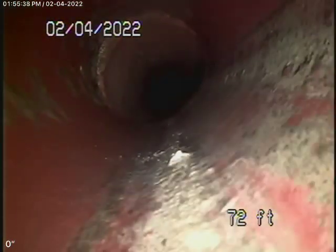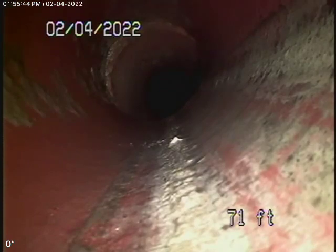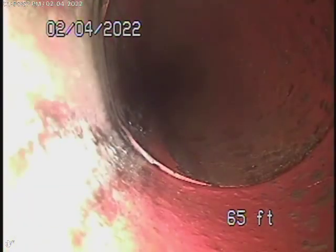That was the 4x6 connection. It shifted a little bit over there, but it shifted in the right direction — it's not going to stop water from flowing. We're looking for big problems like big holes, massive roots, massive dislocations. The only thing we think we might have at the end is some roots that are holding up the camera. As you can see, this is all in good condition — all nice and clean.